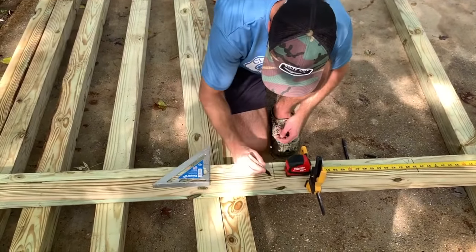on that. But in my case, I'm using this trim and I attached it to the shed frame base with screws, but in hindsight, I should have just used some brad nails because covering those up later with caulk was a pain in the butt. So I'm using 8-foot long segments, so I'm filling in the partial sheets there, and then I repeated this process around the entire perimeter of the shed.